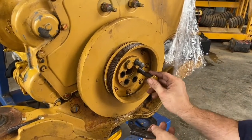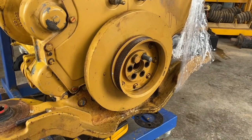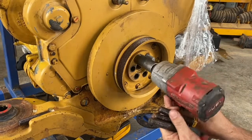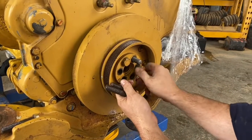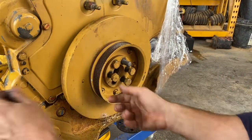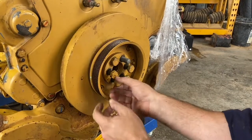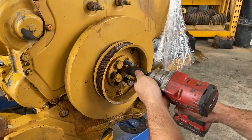When reinstalling an old damper you need to check for damage. That could include a dent, a crack, fluid leaking out of the damper, the paint on the damper being discoloured from excess heat, the damper being bent, or the bolt holes being worn so the bolts fit loosely. Any of these would mean a new damper — the old one cannot be used.